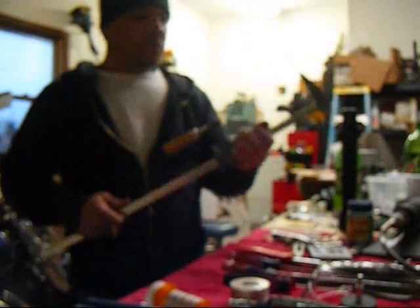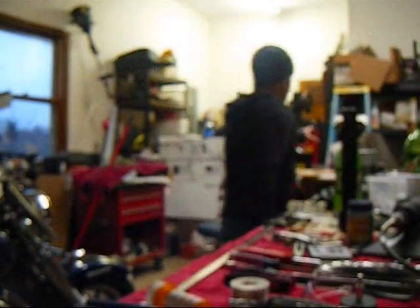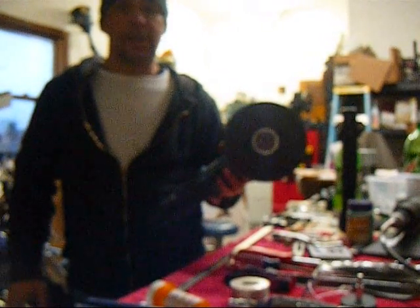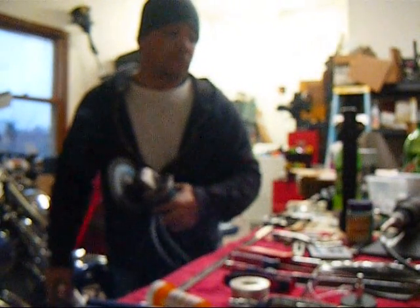These clamps are great. The longer they are, the better they are, within reason. I used these on a small piece of wood so that I could clamp my pipes down onto a bread basket so that I could do the initial cut. Now, what I used to make the initial cut is a Makita wheel grinder. This is a 4.5 inch diameter, but I put a 7-inch blade on it. It's a metal blade. They're real cheap at Lowe's, and you can do it yourself, or you can take the pipes to a metal shop and have them cut it off on a bandsaw. If I'd wanted to spend the money and take the time, I would have done that, but I didn't want to wait.